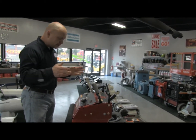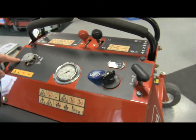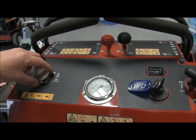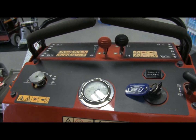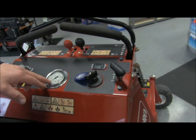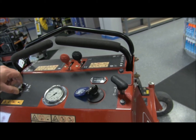To make your PSI adjustment, it's very easy and clearly illustrated here. You've got a dial, and it'll show you clockwise for more PSI or counterclockwise for lesser PSI. Once you depress your button, the PSI will raise as the tines go down into the ground, and you can adjust it while the tines are down or not.